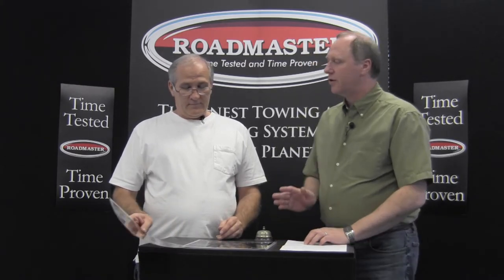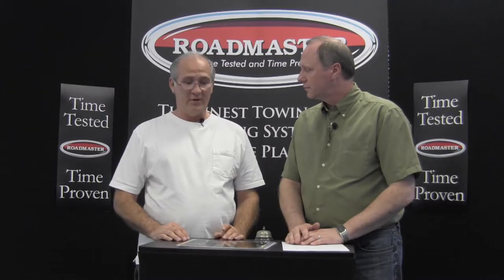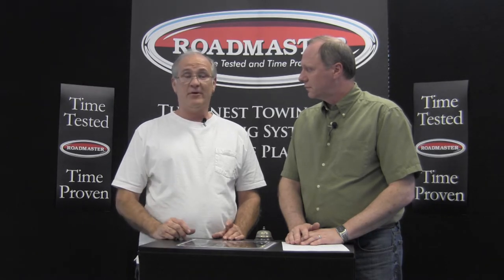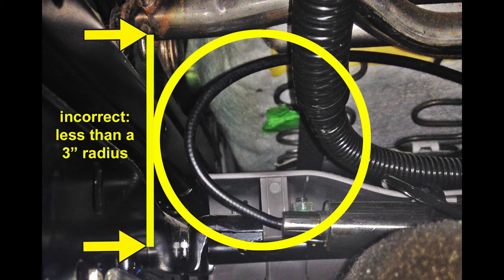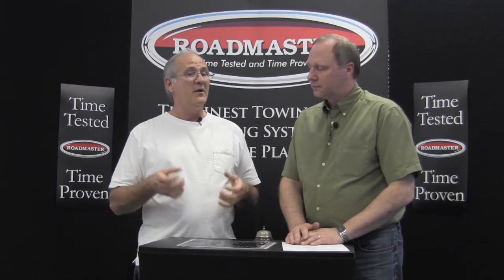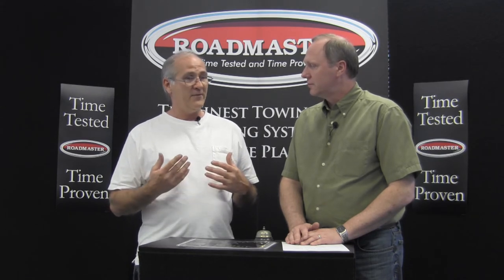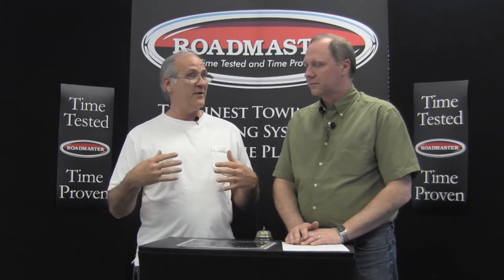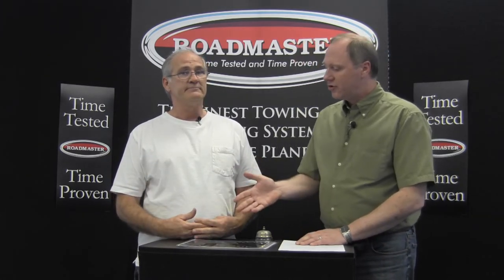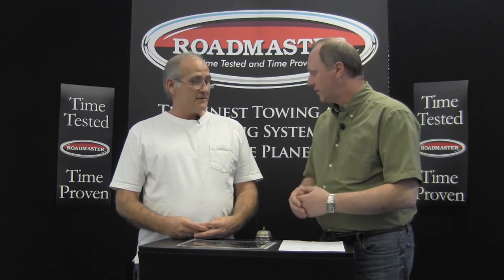Number two: too many turns or too tight of turns of the cable. That's from the air cylinder to the pedal clamp itself. After that black sheath cable comes off of the air cylinder and makes a tight radius — that's not preferable. We want as few turns as possible. If we can get that cable running as straight as possible without making loops or an excessive number of turns, that's ideal. The more turns in that cable, or the tighter the radius, the more resistance you have, making it more difficult for the air cylinder to actually pull the cable. If you do have to make a few turns, you want them not so tight a radius, and you may need to turn the pressure up a little higher in that application.